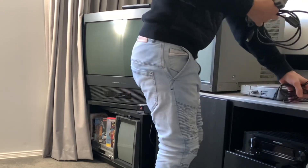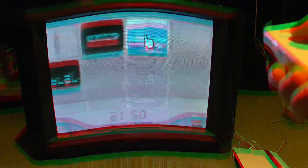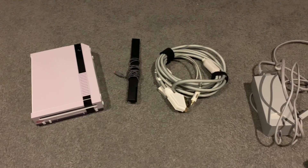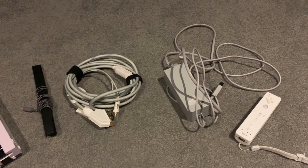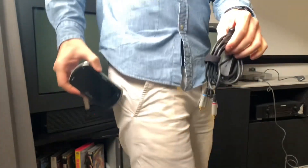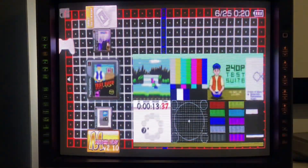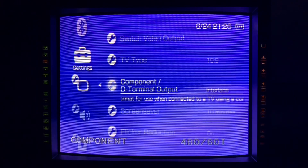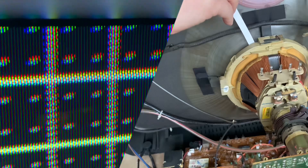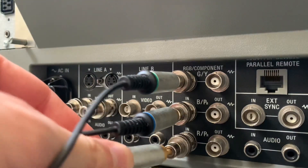In this scenario, it's usually advised to bring along a console that can run the test suite, whether that's by a flashcard or a CD backup. If you don't have a console that plays backups with a flashcard, you could always use a hacked Nintendo Wii. But imagine taking all of this to the seller's house — you're carrying the console, sensor bar, video cable, power supply and remote. Any other console and you can at least omit the sensor bar, but that's still four pieces to lug around. Condensing this down to just two items, the console and video cable, can make the process a lot more convenient. The two e-boots for the PSP can be downloaded via the link in the description, and you'll also need to install custom firmware. To output 240p using a 3000 or Go model, select the interlaced option in the TV out settings. Compared to the PS1 in RGB, the PSP's component video is lacking just a bit in sharpness, which could arguably make convergence adjustments less than ideal, but this is a game changer for testing component enabled CRTs on the go.